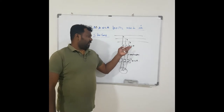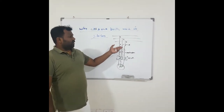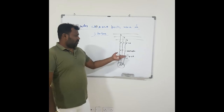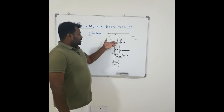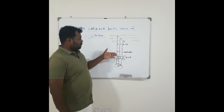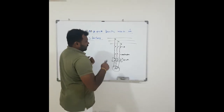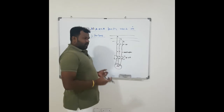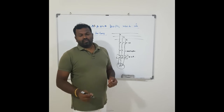In this starter, both the circuit breaker and the overload relay are installed. Both will trip during any fault. But why are we installing both? Because these components are doing different types of protection. The circuit breaker is doing short circuit protection, and the overload relay is doing overcurrent fault protection.